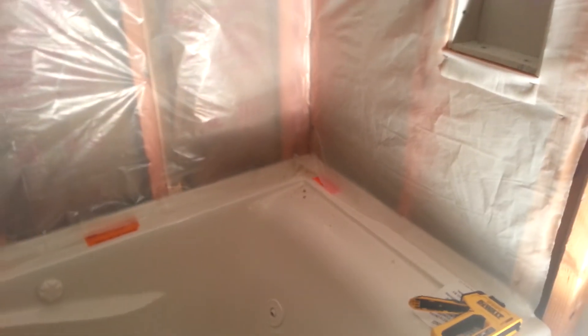I put plastic all the way around here, and like I said, it didn't go quite to the ceiling. I'll come down there on the tub and cut that off before they actually tile — I'll leave it on until I get the backer board on. I did put some roofing nails — you can see them on the 2x4 — to make sure it doesn't move up or down. Once I get the tile and stuff on there, nothing's going to go anywhere anyway. It's all set in mortar — I had to use a couple bags of thin-set mortar underneath there, so it shouldn't move.